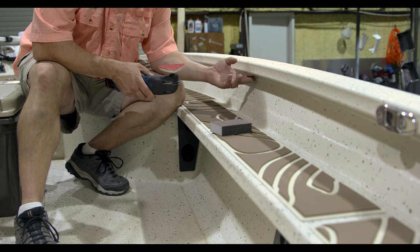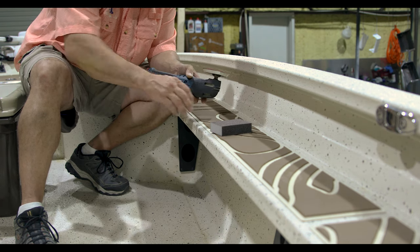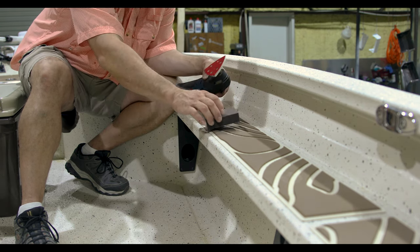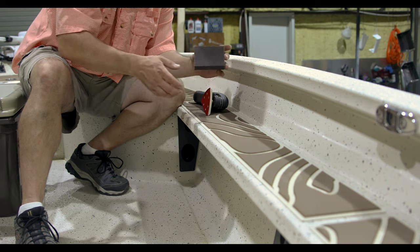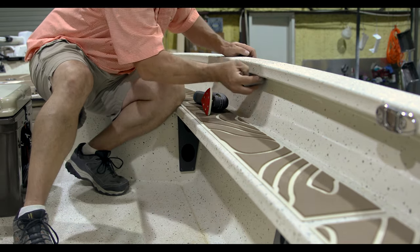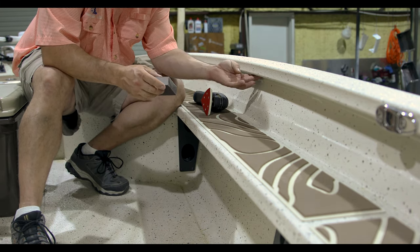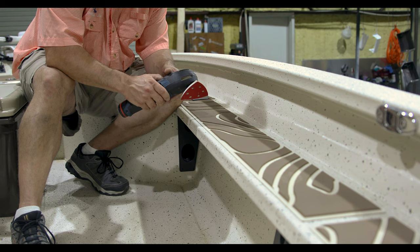We've done this with a lot of success in our shop on installs. We go through the time and do the measures that it takes to get this prep right. We found several tools that can sometimes speed it up, and sometimes they cause more problems than it's worth. You can use air grinders, whatever. But we almost always come back to a sand and sponge. It's just real quick and easy. You can just go under here and rub it right down, and then you can see all that powder paint material, and then we almost already have a smooth surface under there. We'll try this a little bit.